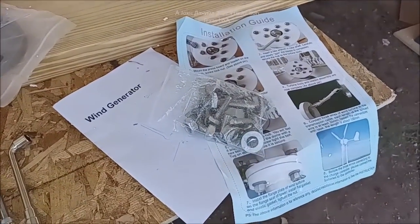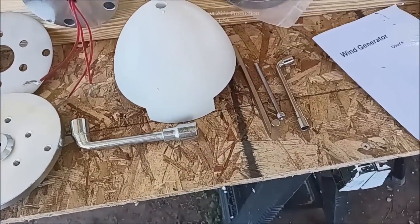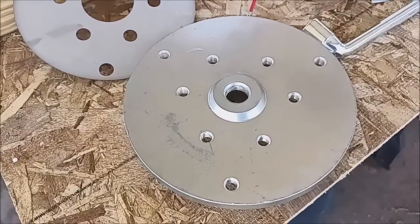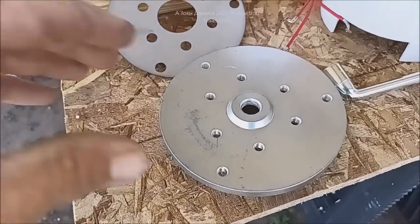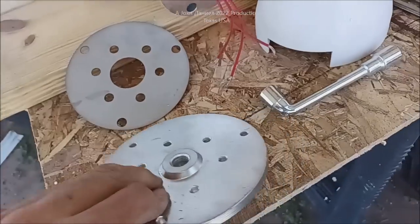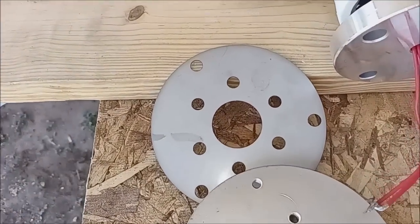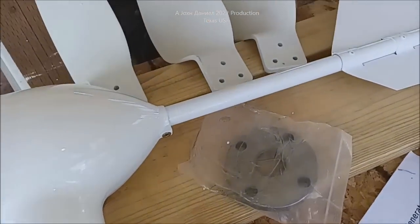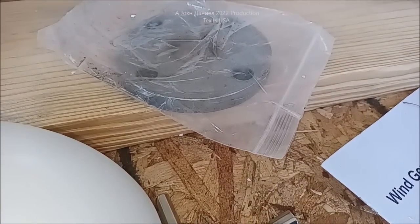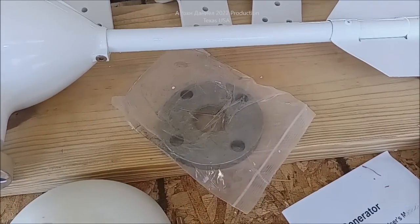It comes with some pretty simple stuff — all the hardware, even the tools. I love getting these little tools because I throw them in the back of my truck and one day they always come in handy. This one has a newer style hub — it is a much nicer hub. It's not casted; it is a big machined hub. It has a plate that goes over the top, it is a pressure plate, and three bolts. Comes with a full-scale 7/16s thick flange — a weld-on flange — and we'll be showing you how to do that, and how to preheat these to use a little 90 amp MIG, a $120 MIG.